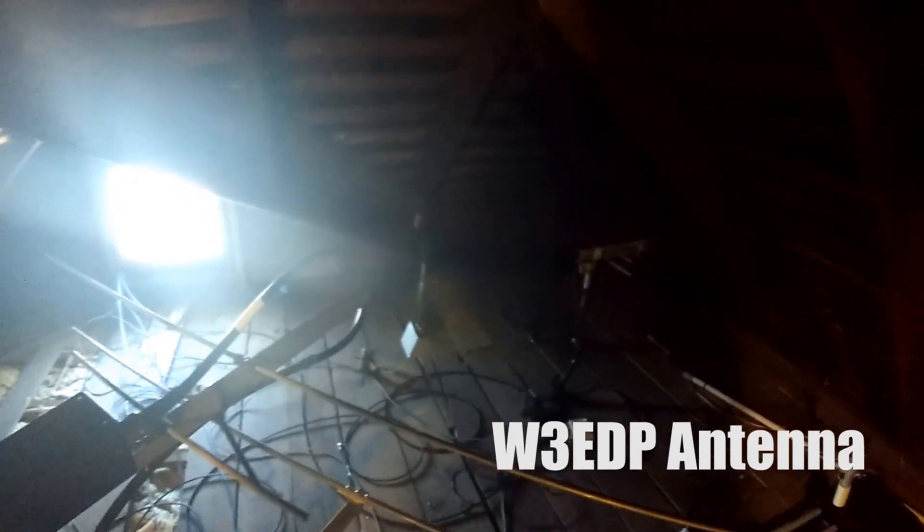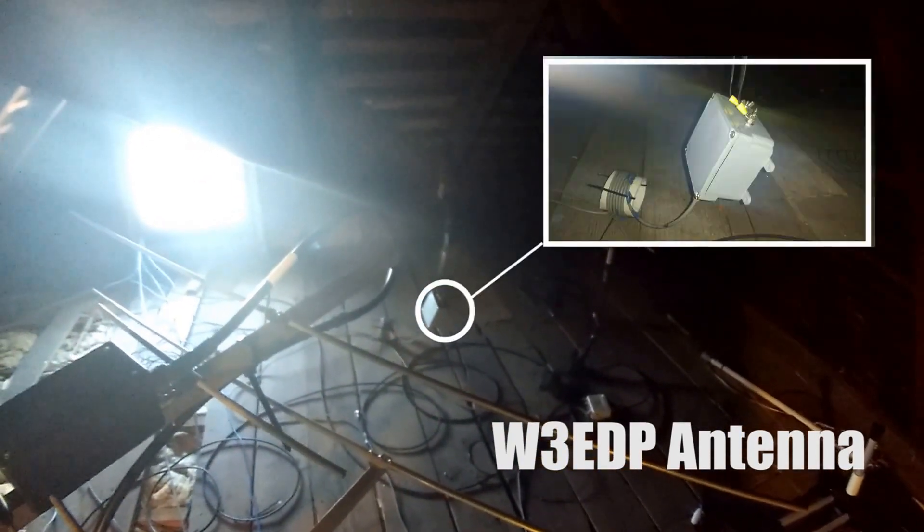And here is the ladder line. This is actually the low band antenna, and I'm using it on 40 meters all the way down to 80 meters. This is a W3EDP design. The balun box is over there and the feed line goes into the shack on the second floor — that's my main shack. This is where the feed line comes in and the radiator goes out from in between the shingles. This is a very stealth antenna.